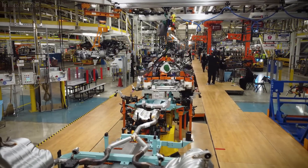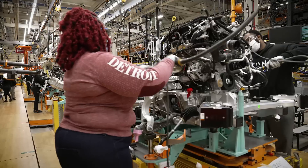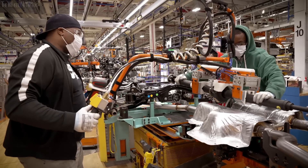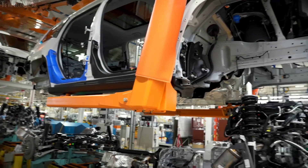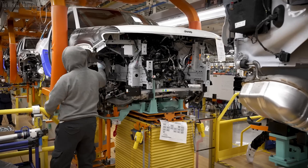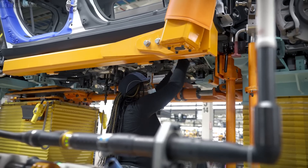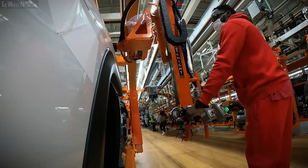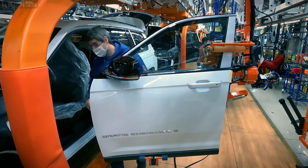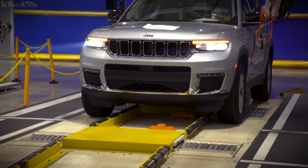As it goes from trim, it merges with chassis. In chassis, we start with the engine at our engine pedestal line and then our dress line, move that over to our carding system on chassis one, and finish up the underbody. Then we marry the body and chassis together. In chassis two, you're connecting major hoses for coolant, lines for AC, and major electrical connections from chassis to body. It then transfers into final assembly — seats and more major components — then we hang the doors on final two and put the wheels and tires on.